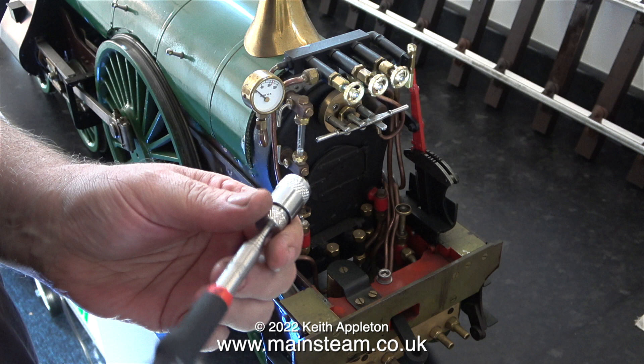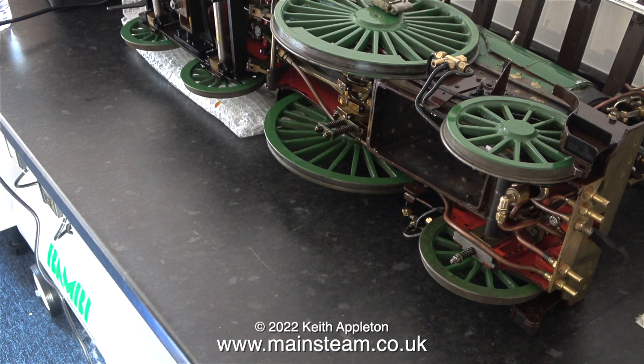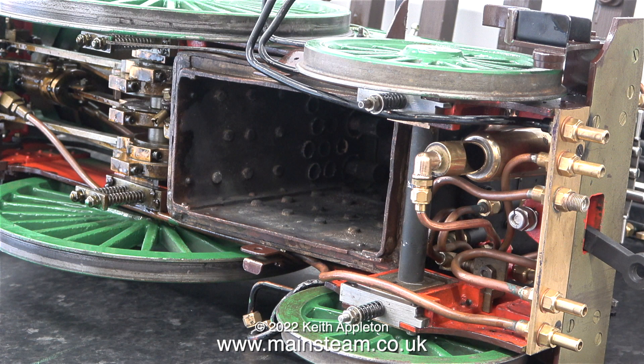And you may have guessed — I got it wrong. My logic told me that the two outer ones must be the water inlet for the injector, the centre one with the pressure union is obviously the hand pump, and the remaining two are for the axle driven pump feed and water bypass return. But here's a better view from underneath and you can clearly see that is not the case. From top to bottom: the first two are the injector water feeds, the next one is the hand pump connection to the boiler's check valve, then the return from the bypass valve to the tender, and the bottom one is the water inlet to the axle driven pump.